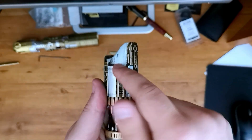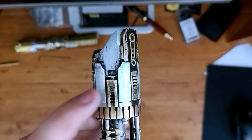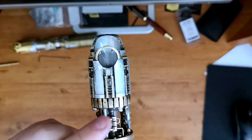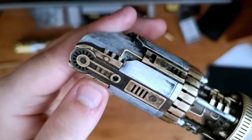This is made to fit a clicking slide switch — the angular one — instead of the normal tactile one. For that, we have the brass insert to fit the clicker switch. We have the inserts here for the glass eye, our center insert, and our accent insert. We have our switch cover and two details here, and you'll notice these are drilled out with larger holes and fitted with copper.